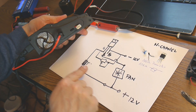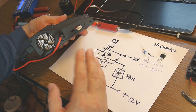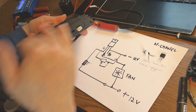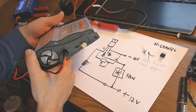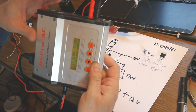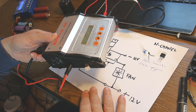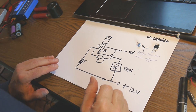The one challenge — it's not really a problem, but something very sensitive — is finding the right point with the trimmer, between the two voltages, to get the correct range for the fan. Now you see the inlet is free, a lot of air is coming in, and the fan is cooling down. It's a very simple schematic.